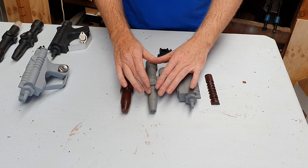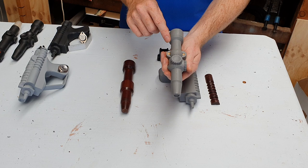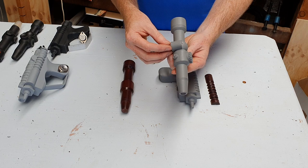What I also added to the wooden master that I have here was the top of a scope ring. Just one of those. Took the top off, glued it on there, and then filled out the base of it with some timber and lots of putty. Sanding, lots of putty. And some more sanding, and probably a little bit more putty.